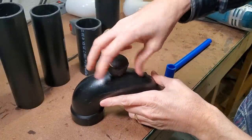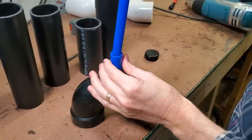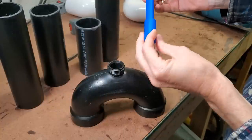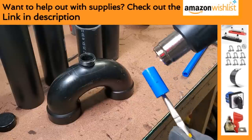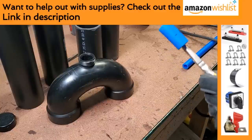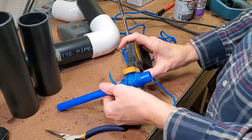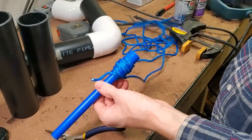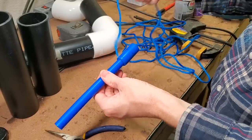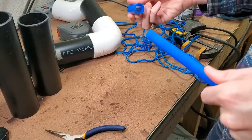My plan for the ventilation system's drain is to fit some PEX into this return bend. The larger PEX piece fits perfectly in the clean-out hole. The smaller PEX piece, however, has a bit of play inside the larger piece. I had seen a cool method where you heat up the pipe, place it over the smaller pipe, and quickly wrap it with a rope to make a perfect fit once it cools. I heat up the larger piece for one minute and the method works perfectly. The two pipes now tightly fit together, but can still be removed.